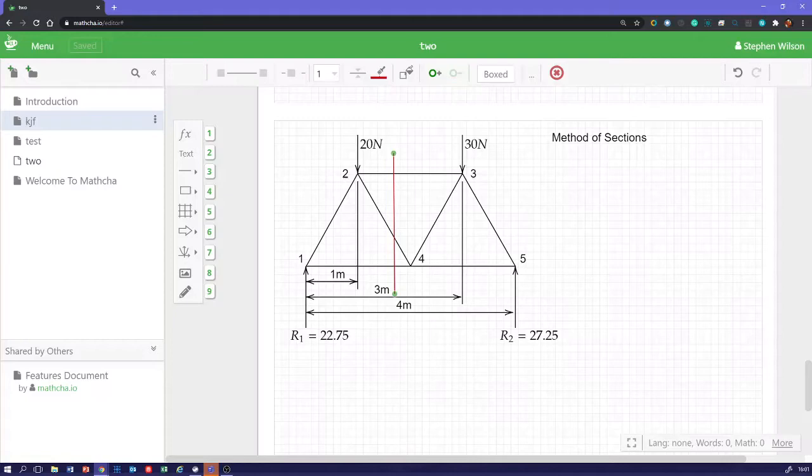And we can chop it around here, around the red line, because that's near the middle, and the forces at the furthest point between our two supports will be where the forces are greatest. So if we're using the same material throughout the frame, and the material can withstand where the forces are greatest, then that's going to be okay, isn't it? That's going to be fine. The forces should be less at the supports than they are in the middle. Okay, so we'll work our way through that.